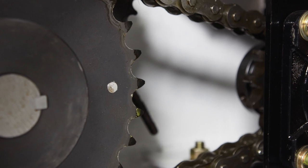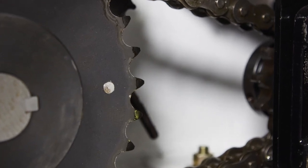Your lower shear pin is held just by one grub screw at the rear on the arm. You'll need to undo this grub screw to release it, and it's probably more advantageous if you tap the arm round to locate it and put it back in line again.